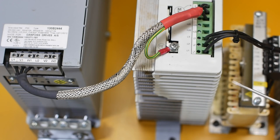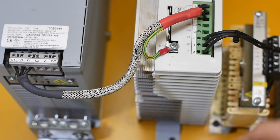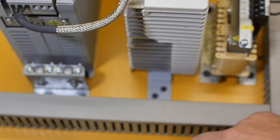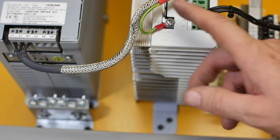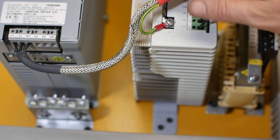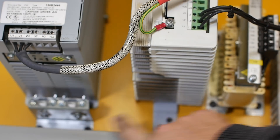I still need to tie all of these earths to a central earthing point. I was told to keep this line as short as possible. Now it might be neater to take that down into the cable channel or even to a terminal block and then back up, but I guess it's better to have low EMI than neatness. What do you guys think — would you run it straight across or go down and back up?